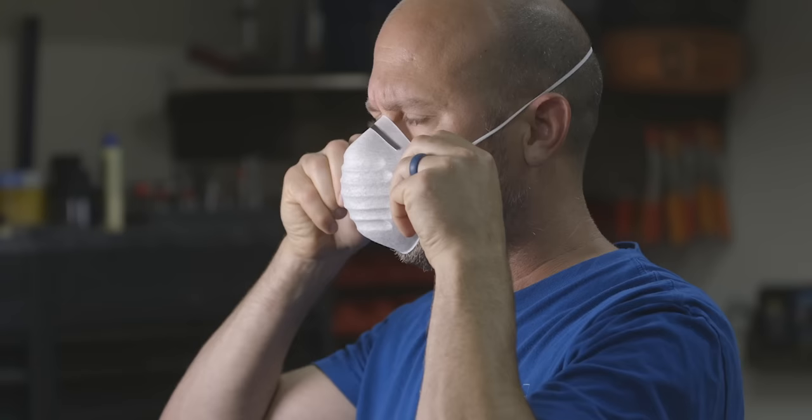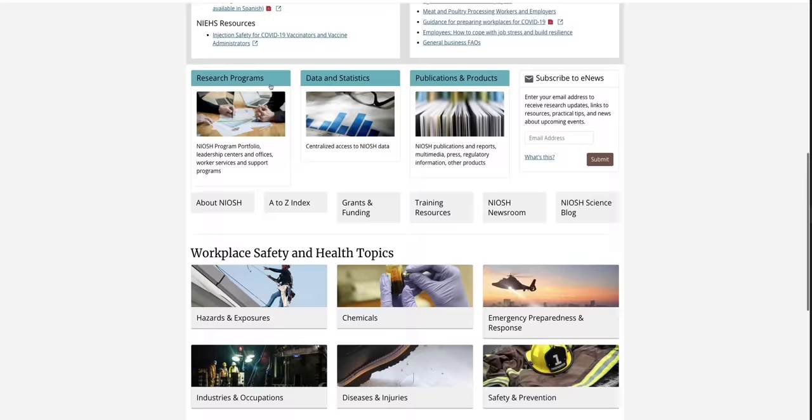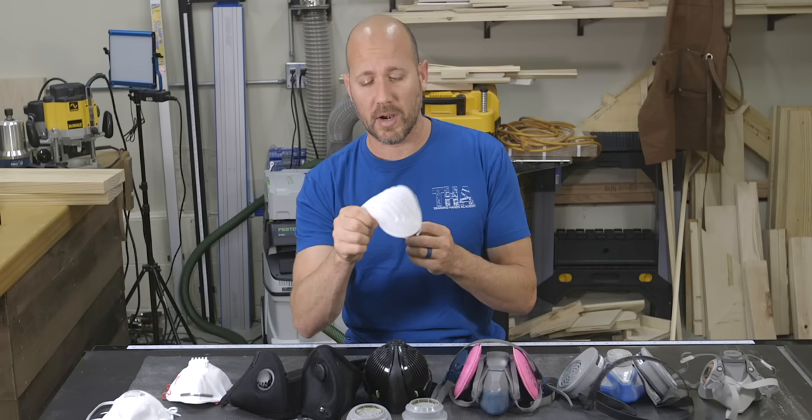The other big difference between a mask and a respirator is that the mask is not NIOSH approved. NIOSH stands for the National Institute for Occupational Safety and Health, and I'll get into what they do later on. Bottom line, most professionals think that these dust masks are useless, and I have to agree. A respirator, on the other hand, is certified by NIOSH and generally has two straps, which allows the mask to fit snugly around the user's face.